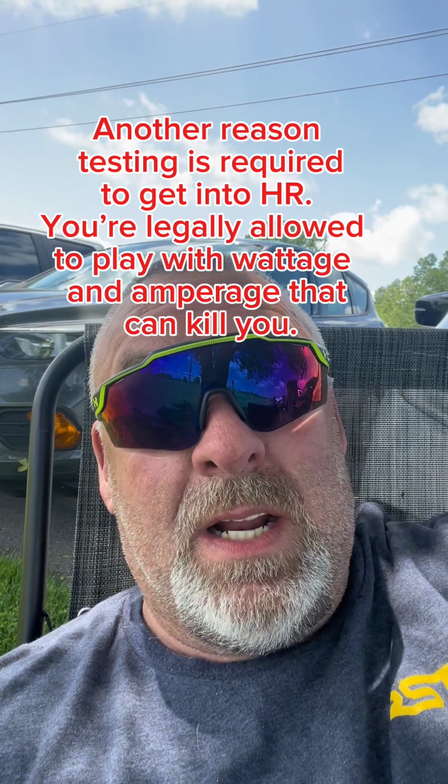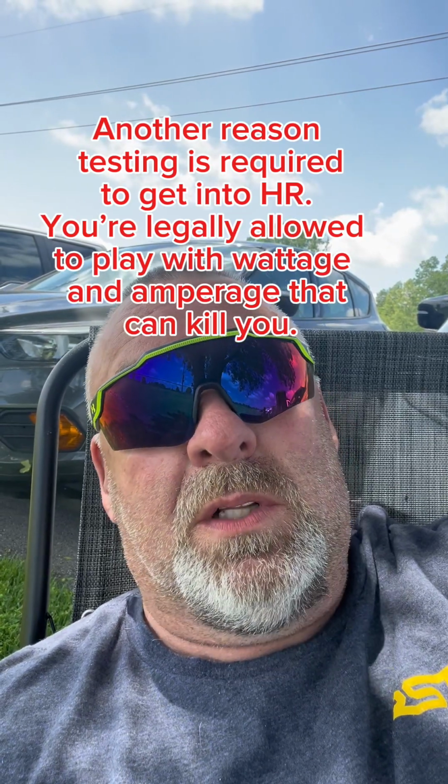Now, a disclaimer, please, for the love of God, do not open your amplifier if it's been on, plugged in. Turn it off and unplug it for many, many hours. 12 hours is probably best. I mean, it probably would discharge within an hour or maybe less, but to err on the side of caution, please let it discharge because it ain't no joke. That transformer in there, they got stickers all over it for a reason. It can and will kill you. So let's not do that.